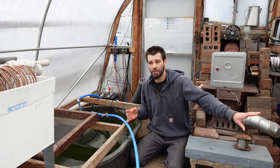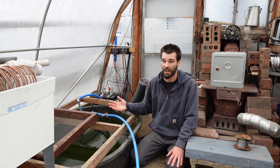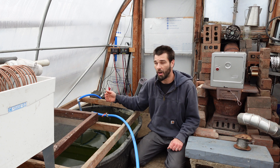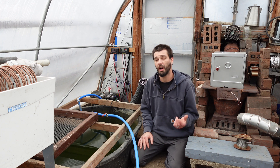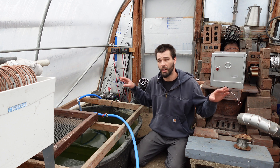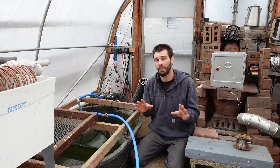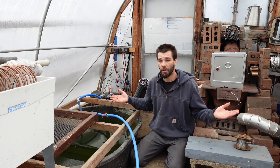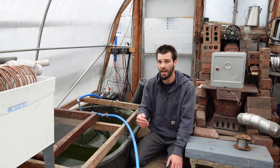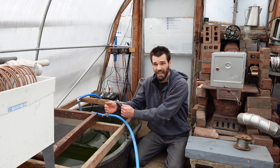We've been very lucky to have this preparation period to get plants going and systems like this set up — our geothermal is constantly running, our air heater, and our DIY compost space heater. That's why I swapped the fan to a 12-watt draw as opposed to our larger fans that were drawing almost 25–30 watts per hour. We halved the draw and can run both fans with no sunlight. On rainy days these will still pulse; they still perform their duty, just not at a full rate.